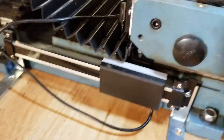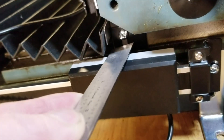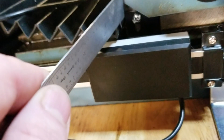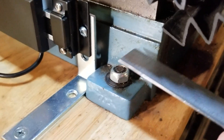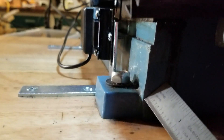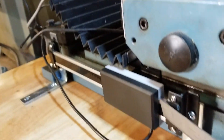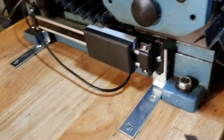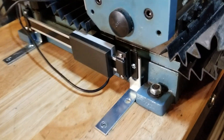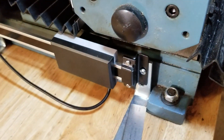Down here I used the original mounting bracket — you can see it right here — and I had to cut a spot out on this side for everything to clear. I've seen a lot of guys mount it to this surface of the mill, but that surface isn't vertical; it's sloped. I didn't want to deal with keeping this bar on an even plane at 90 degrees. Since this mill is mounted to the bench and I have no intentions of removing it, I just mounted a couple of L-brackets front and rear, butted up against the legs of the mill base and screwed down.